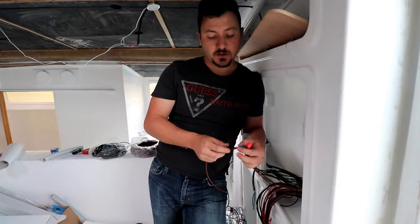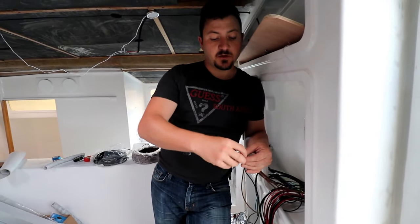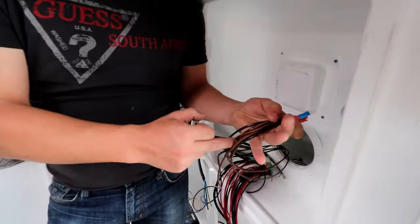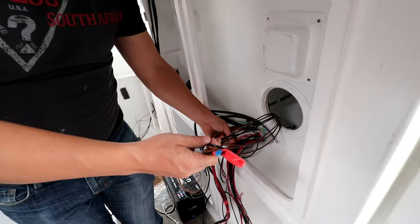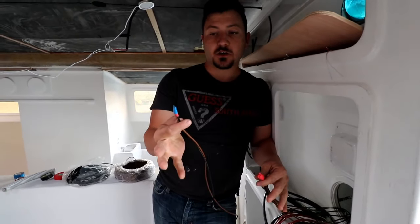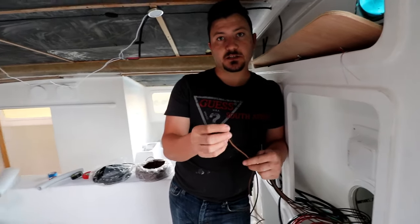When making a harness, I mark each cable. This will be the only cable in that whole harness that is a blue and red pair. I get them all together - they're all different colors: blue, black, red - then tape them all together and draw that through the harness. Two harnesses per side, excluding the lighting cable; these are all 2.5. All the harnesses are marked so I know exactly where each cable goes - for example, this one is marked as the underbunk water pump, or kept as a spare for a water pump I plan to install later.